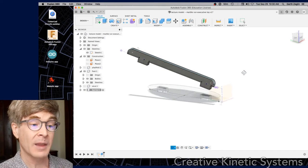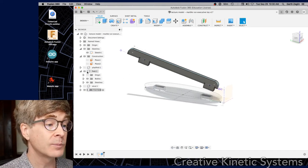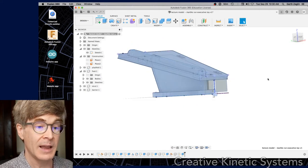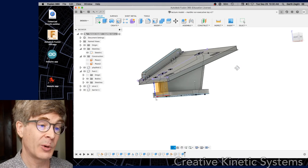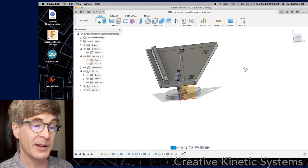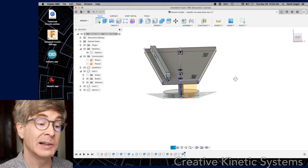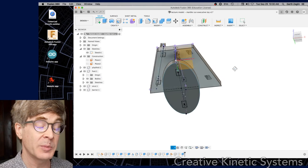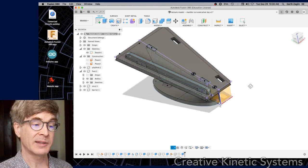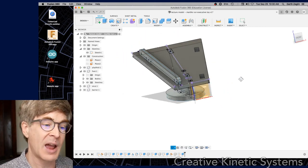That should be a part that press fits in. Let's look at what we have now — the play field and the strut. We do have a strut that will press fit in. It's not terribly tall but it's probably enough for now. We left a fairly hefty margin so that the slots have some material thickness there on the outer wall. It's not the most beautiful design but it will work. If we were willing to use more glue we might be able to miter that more closely, but having a nice pounding-in slot is good for a hammer fit.